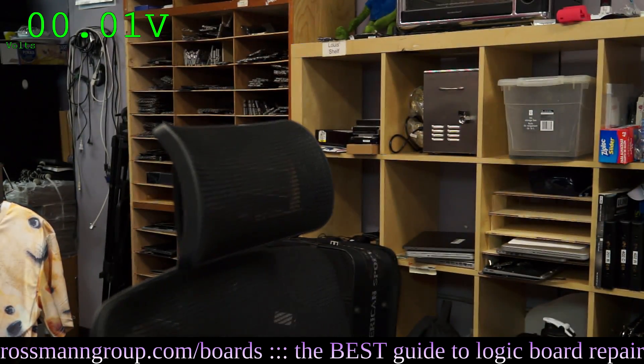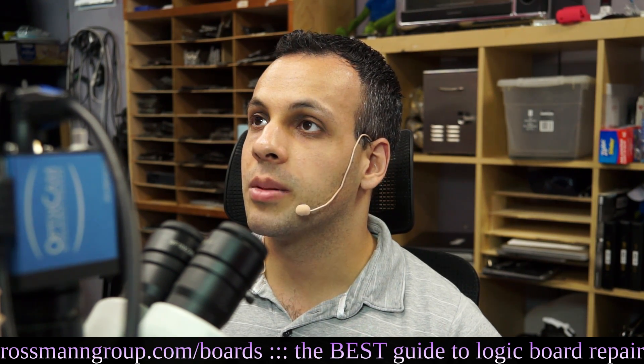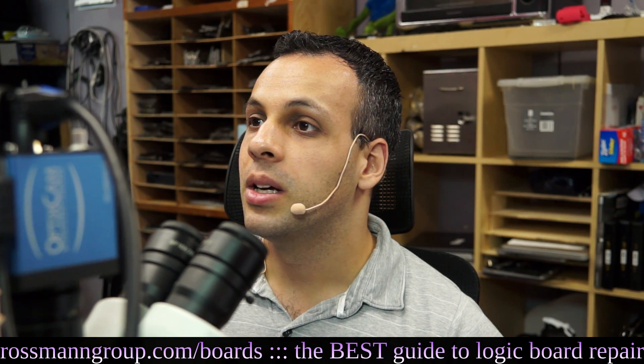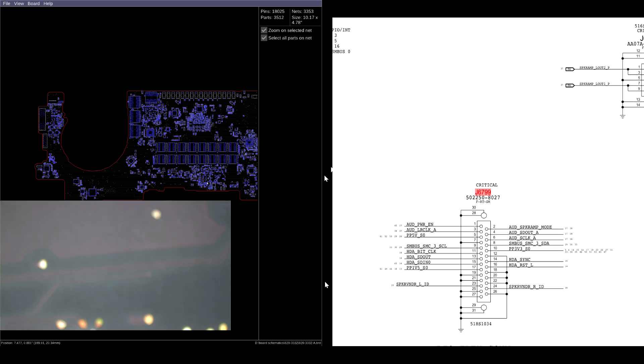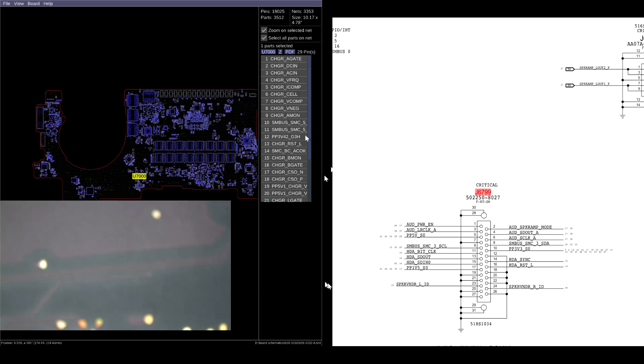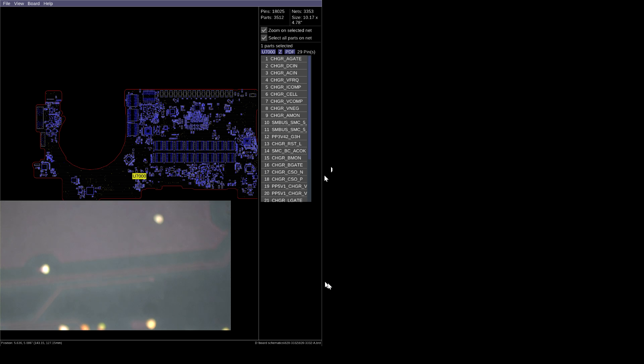So they replaced their own battery. The first thing I'd like to look at is the battery charging chip, since it's going to be responsible for charging the battery. The board's described issue is not charging the battery, or it's dead after replacing the battery. This here is our battery charging chip - the ISL6259. Ignore Apple when they say it's an ISL6258. It is indeed an ISL6259.